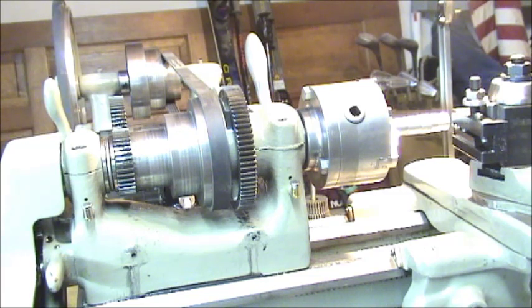because you do introduce some oxidization into those little pits, especially if there's any kind of residual oil in the cast iron itself. So that's why I had a couple of those little pit holes, but those little pits weren't down to the base metal, so they are strong enough to hold the load. And that's basically a down and dirty repair for a back gear.